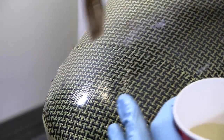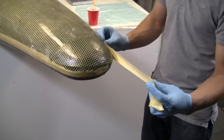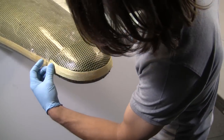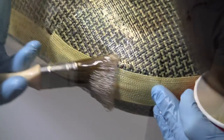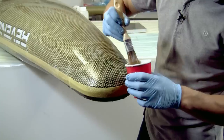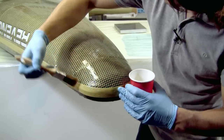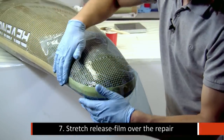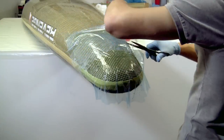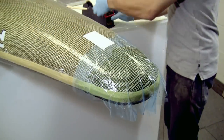You need to be very careful around any areas where you've cut the fibre. If you're too rough with it, it's very easy to fray — and although it won't structurally affect the repair, it won't look as neat. Once you've wetted out all the fibre nice and evenly, just give it a little brush of a bit of extra resin. Then when we stretch the release film over the top, we can squeegee it out and it'll leave a nice consistent even finish. Trim off the excess release film and tape it back to hold it tightly over the repair. The odd little wrinkle won't matter — that'll smooth out on the final finish.